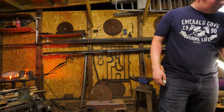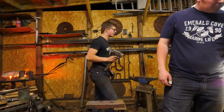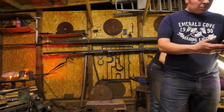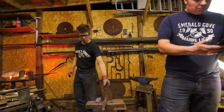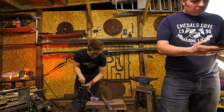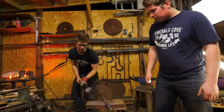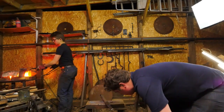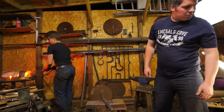Okay, so what happened here is the last time I used this drift, I forged it by forging too much at too cold a temperature, which means it's getting stuck in that little area. So it made it a little more difficult to pull that drift off. Right, I'm going to take one more heat. I'm going to go in that side of the eye again. I'm going to get another one to see. Go the other one. So indecisive.